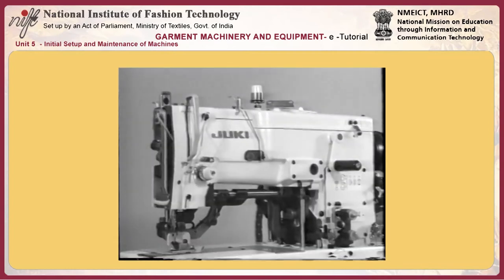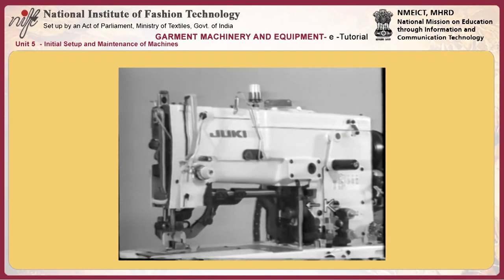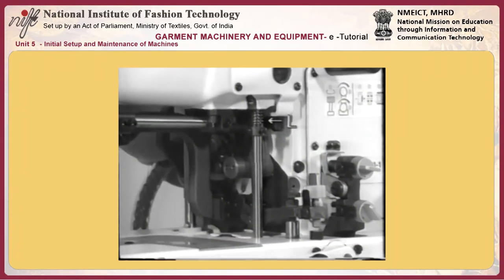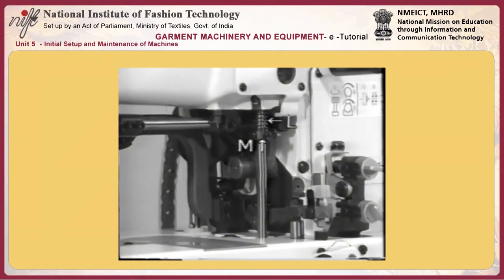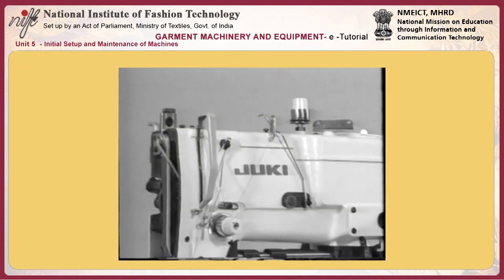32. Adjusting the tension release timing. Releasing the tension of tension disc number 1A. The tension disc number 1A releases tension only when the sewing machine enters the stop motion state and totally stops. The tension disc should float to make a gap of 0.5 to 1 mm. Loosen nut B of the tension post number 1 and adjust the floating mount of the tension disc by changing the installation height of the tension post number 1.